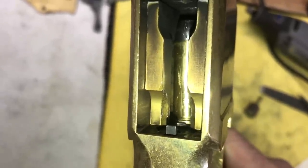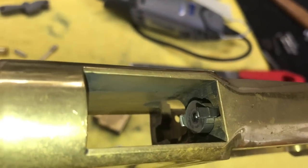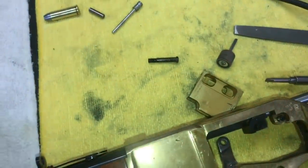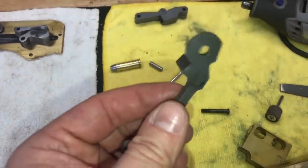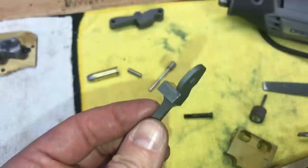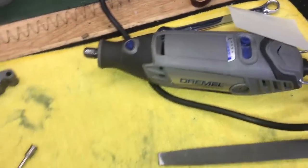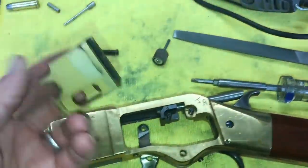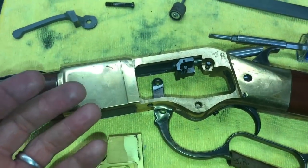It just barely hits it by about five to ten thousandths of an inch. So everything was going well with the lifter arm, except that little tab on the bottom face of the bolt interfaced with the back of the round in the carrier — definitely not what you want. So we're going to keep removing material from this area, ten thousandths of an inch at a time. The end result we're looking for is perfect synergy: the carrier goes up and the bolt goes back without touching each other. The tab on the face of the bolt does not interface the back of the round — that way, when the springs do their job, the carrier stays up, you pull the lever back, and the bolt pushes the round into the chamber.